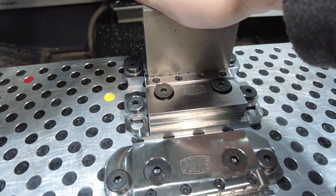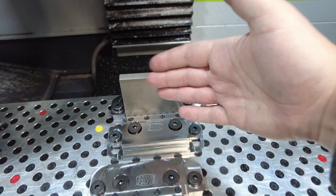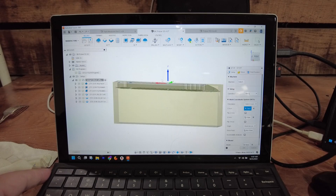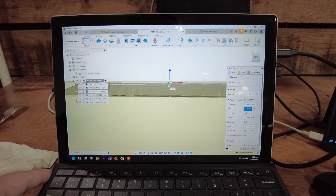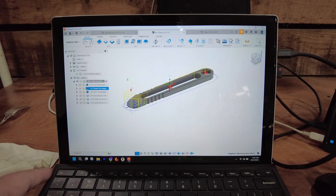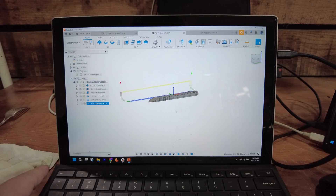This is what my setup looks like. I've got a piece of stock sticking straight up out of the vise. I put a second vise here because when I do production, I want to have two stations going at the same time just to optimize for work holding density. In my CAM setup, the part is centered at the top, Z-axis facing up, X-axis facing right, Y-axis facing backwards with the work coordinate system dead in the center. We use an adaptive toolpath to rough out the material, parallel to finish the face, 2D contour to finish the walls, and then a slitting saw to part it off. Once in production, this will be patterned down about 10 times to get our 10 different pry bars.